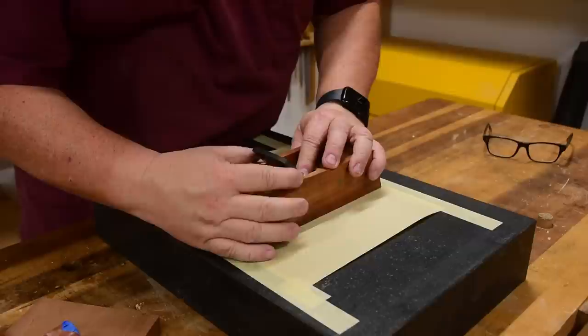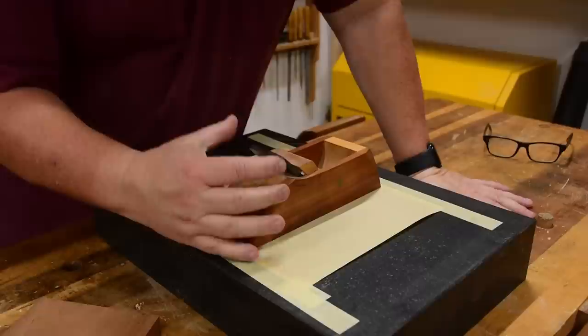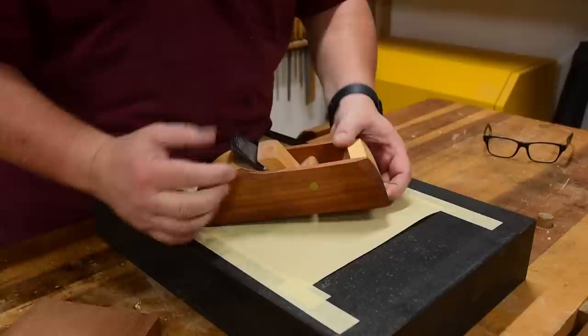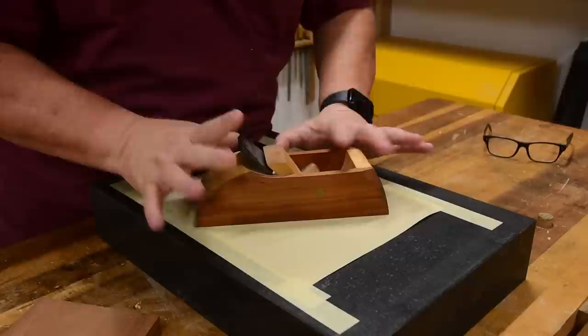Reinstall it so it's perfectly flush with the ground, then lift it up about a millimeter — not too much, just a little bit — and then reinstall the wedge. If you lift it up too much it's married to the bed, so the normal action of tightening and using your plane blade squeezes over there, putting a little bit of pressure right there. That tension kind of locks the base into a shape, so it has to be tensioned in order to flatten.